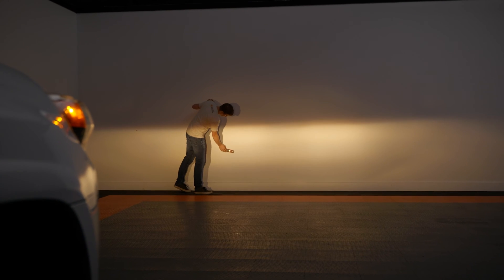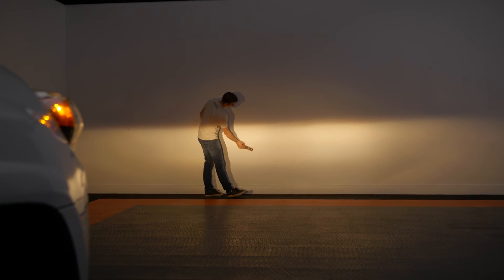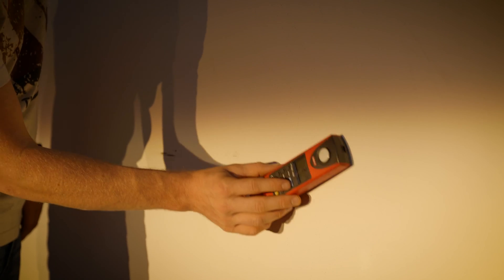The way we do the testing is we put the lights at a certain distance from the wall, turn them on, and measure lux with a digital meter. Lux is the actual usable brightness at a certain point in space, so in this controlled environment we can demonstrate how much brighter one product is compared to another. This is different from lumens — this is actual brightness. Lumens is more theoretical and not really appropriate for these kinds of tests.